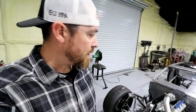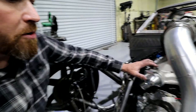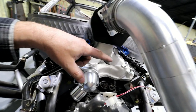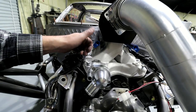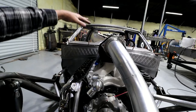But yeah, it'd be cool to get all the cooling stuff set up. What I may do as well is put a vent up here on the front. Part of the struggles of a setup like this is getting all the air out of it. So if I do some kind of vent setup right up here on top of the intake, one of these will have to be for like a coolant sensor for the standalone ECU, but the other one I don't really need, so I could put a vent set up in one or the other, and I could kind of crack that thing open as I fill the radiator from the rear. It allowed all that air to kind of escape out the top of this thing, and then as soon as it starts to bubble water, close the vent, fill it the rest of the way up, and should be ready to rock and roll.